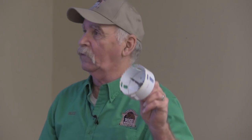Now the plans that you get from Home Depot, they want you to use a 4-inch and a 5-inch hole saw because they had the people cutting 5-inch discs with a 5-inch hole saw. Well, there's 35 of them on there. It'd take you a while. So we used a band saw, a table saw, and a planer, because they're having people buy half-inch by half-inch square dowels and 1x2 wood, 1x3 wood. No. We're going to make our own dimensions, and we planed it down. Some of the things I planed down to half inch to make it a lighter piece.